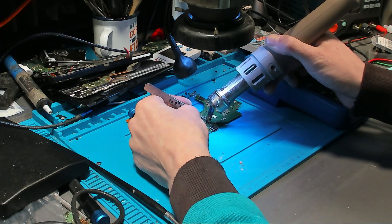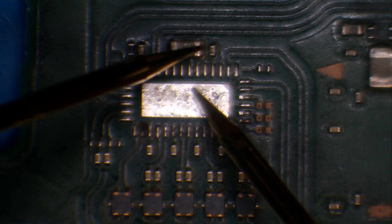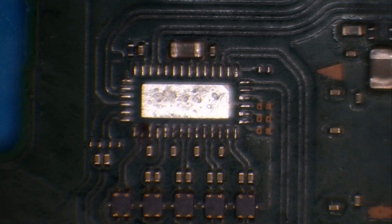So we remove the chip and clean it up to get to the pads and straighten that trace back out. It is a common thing that happens when there's damage on the port — one of those traces will end up blowing. Unfortunately, as you can see, it didn't blow quick enough. Too much voltage went through the data lines, it took out that trace because they are really weak traces, and it also took out the CPU.